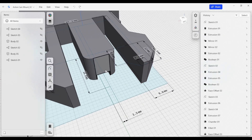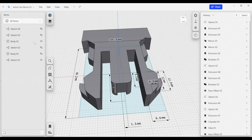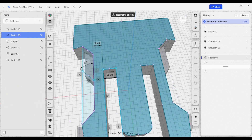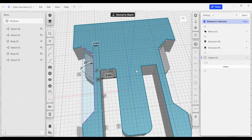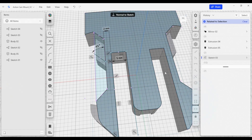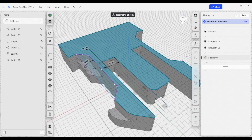The very next thing we want to do is address the thickness of this tine here, and the way we're going to do that is simply by going into our original sketch and driving this geometry just by changing these dimensions. This goes into a little bit more forethought when you're creating your sketches as to what dimensions you want to use, but this allows me to very quickly update that model without having to add additional features like face offsets.